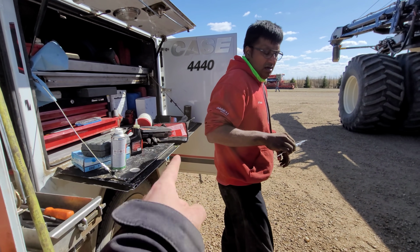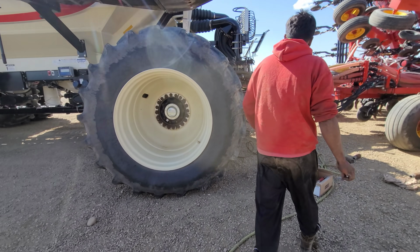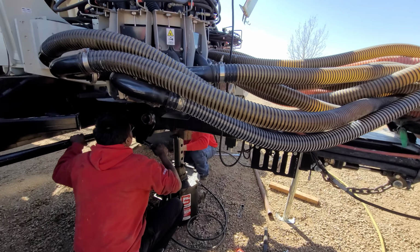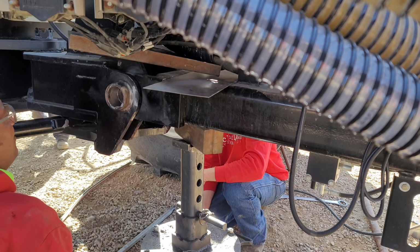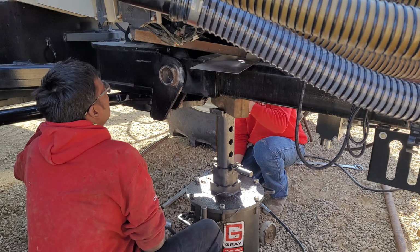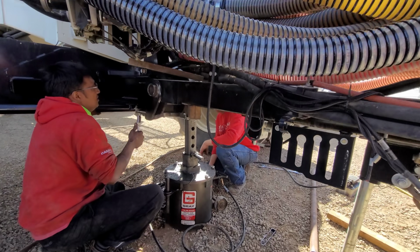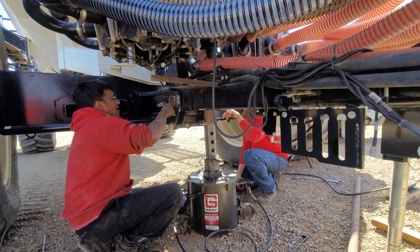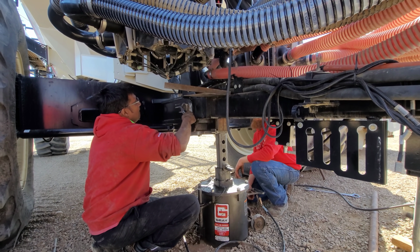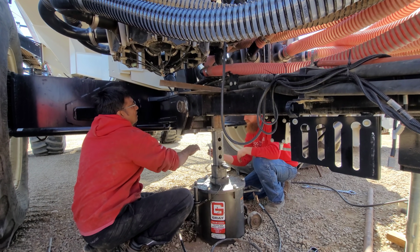So you're just measuring that pin right now? Yeah, I'm measuring that new pin, just to make sure that they didn't make their pins a little bit too big. We're gonna measure the hole. You see how this hole is lined up right now? Yeah, that one is perfect. But this one's not. Nowhere near. You better check that other side. This is gonna be swelled up a little from that heat. Yeah. 2.7, the same. 2.7? Yeah.